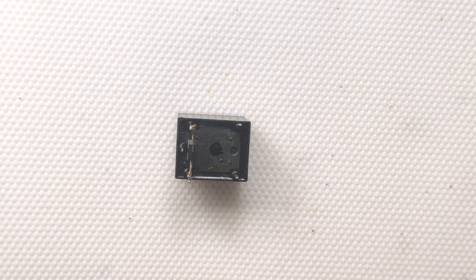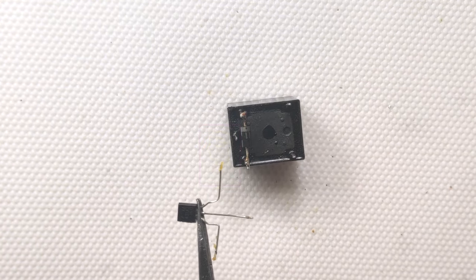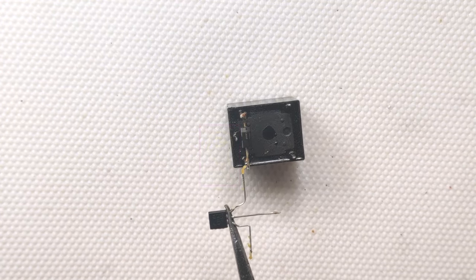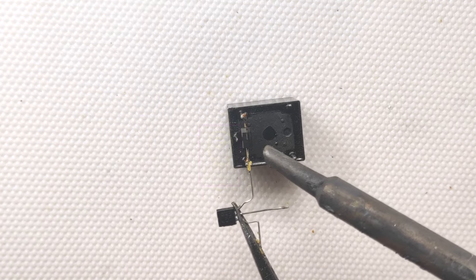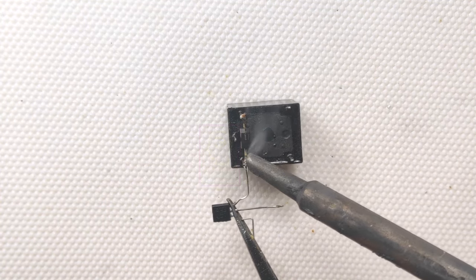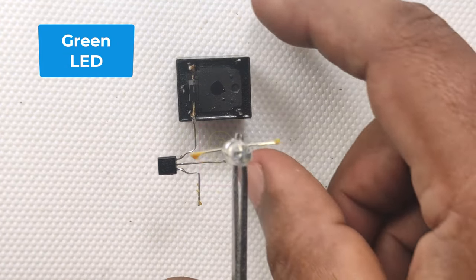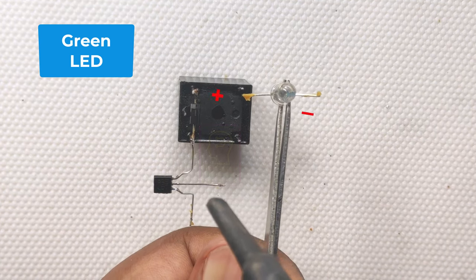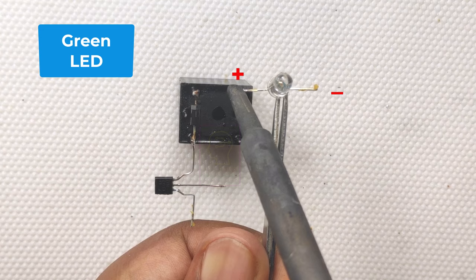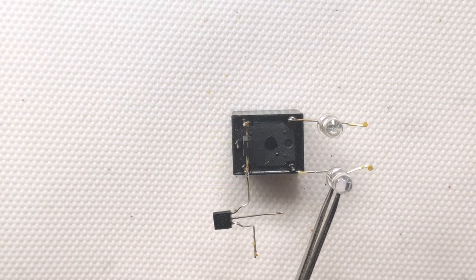With the use of an external voltage divider, the TL431 can regulate voltages ranging from 2.5 to 36 volt and at current up to 100 milliampere. We cannot give this directly to the battery because of small current, but we can drive a relay which can handle high current. TL431 is used in SMPS power supplies, battery chargers, over voltage protection circuits, etc.